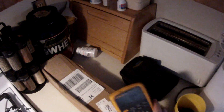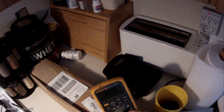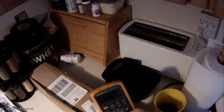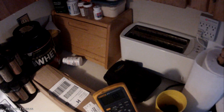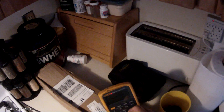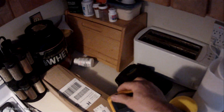What's good about this meter is on the ohms it's got a 400 scale instead of a 200 scale. Same thing with the Fieldpiece 36 — it's got a 400 scale instead of a 200 scale. It's very important to have that for the ohms; there's a lot of things you need the 400 reading meter instead of the 200, because the 200 won't pick up a lot of things on ohms — like checking the igniters and stuff like that. So you don't want to buy a cheap meter when you're checking stuff for ohms.